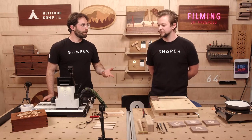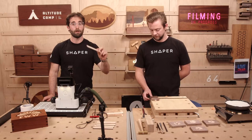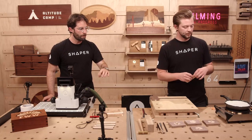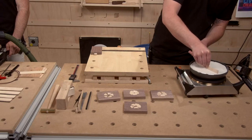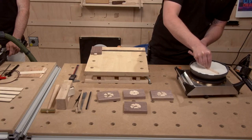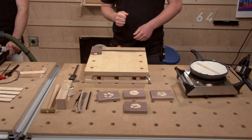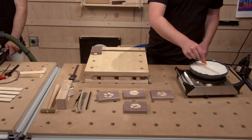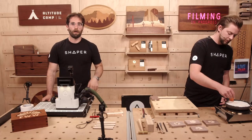I really want to show you all the process start to finish. We actually have a couple unshaded pieces of veneer here. Jake, would you mind nesting that in the sand? Just wiggle it back and forth and nest it all the way to the bottom of the pan. Could you start a three-minute timer? You want to get it all the way to the bottom so that you get that nice, dark section. Jake and I will get a little notification in our ear from Goose that time's up and we'll pull it out. As that shading is happening, we can keep talking about what specific processes we follow.